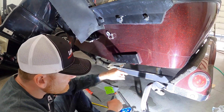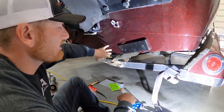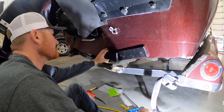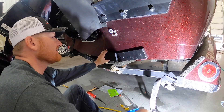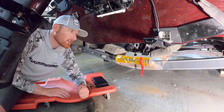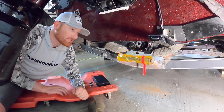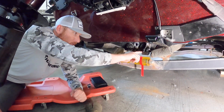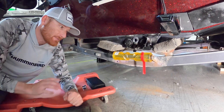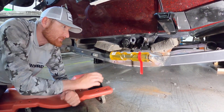You want to stay away from all the strakes and generally want to get the transducer closer to the inside of the boat rather than farther out. Over here is going to be where I add the big side imaging transducer — that's where my money is going. If you've watched any of our videos on transducer placement, we've done a lot on how important it is. Everybody asks me about settings — it's not about settings nearly as much as it is about transducer placement.